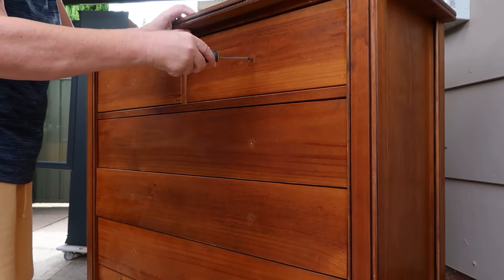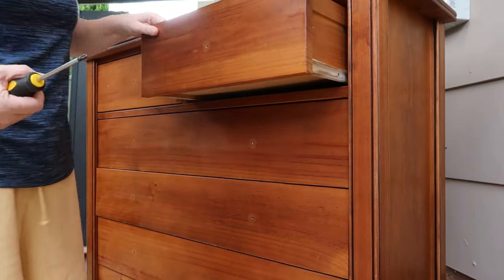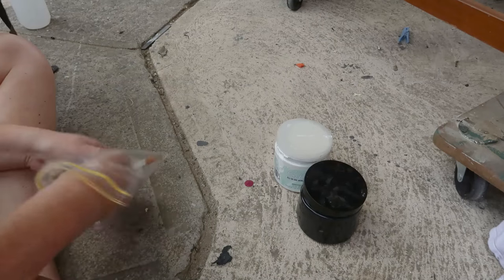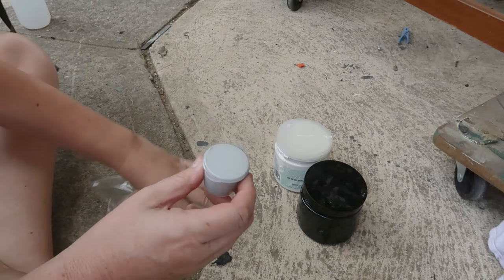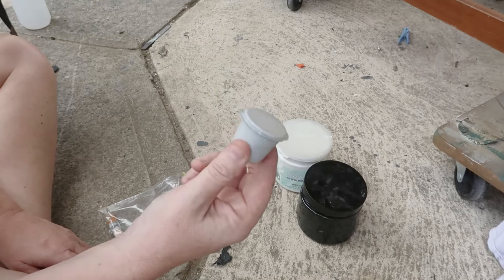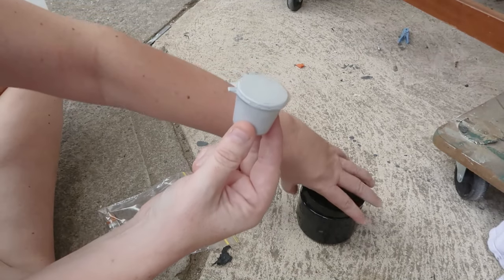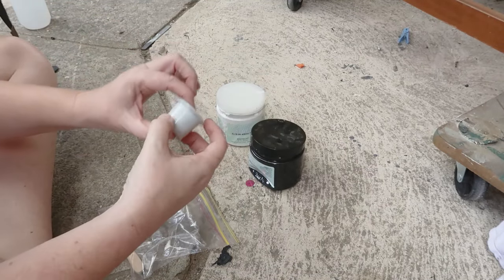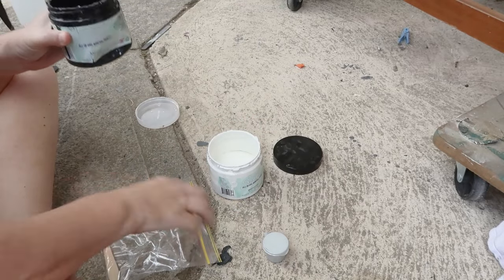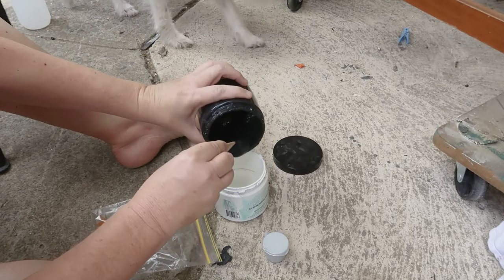Quick tip — when you take out the drawer pulls, put a screwdriver into the hole and pull it out. So this is the colour I want to recreate. This little care package I put together for the customer ended up being for me. This was 50/50 Dixie Belle Silk White Cap and Dixie Belle Silk Wharf. I don't have any Wharf left, so I'm going to go with White Cap and Anchor — maybe 20% anchor. Let's mix it in and see how we go.